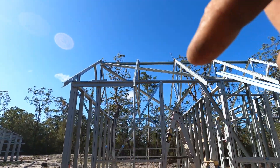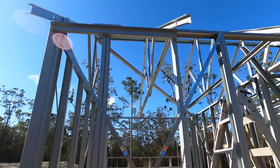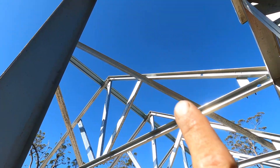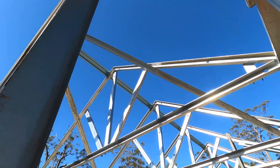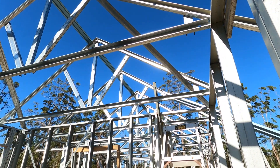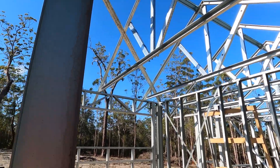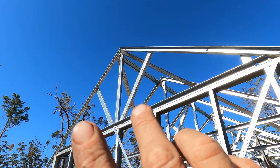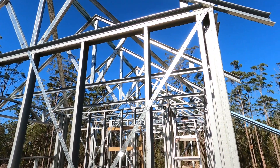We've got these braces here — one going out that way up in the roof frame. They're screwed up to the underside of the truss and then down to the top of the top plate. Because they're on 45-degree angles against each other, they brace the gable end. The gable end is this flat end here and it gets a lot of wind loading, so you put those braces in to brace it.